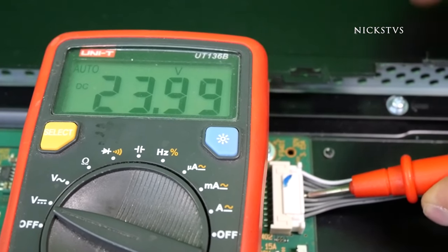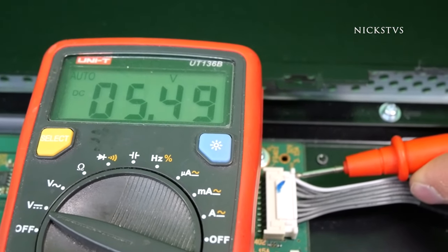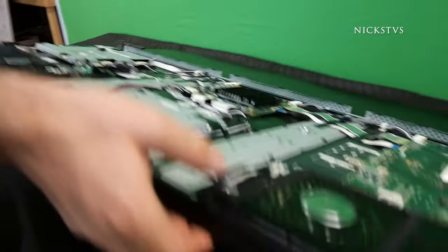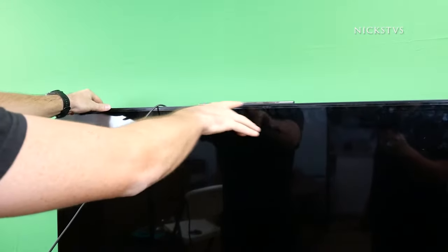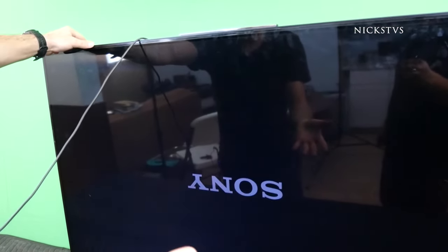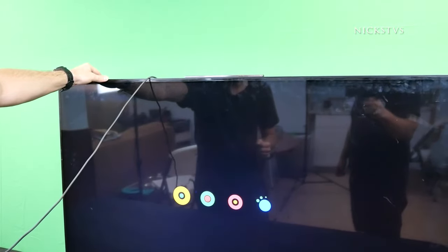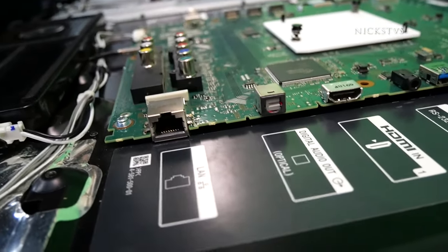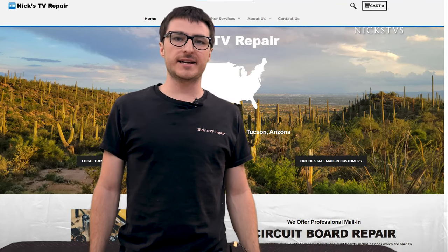I just reinstalled the DPS board, and looking at our output voltage to the main board we are now getting our 24-volt output and also 3.4 volts. Let's plug it in and see what we get. It just turned on by itself — we have the Sony logo. The standby light is now turning on. And the optical light down here is showing a red light as well, which is another indicator that we're getting power everywhere. If you found the video useful please leave us a like and subscribe. Thanks for watching.